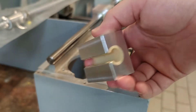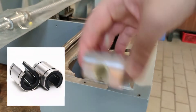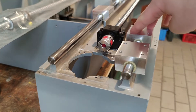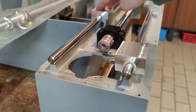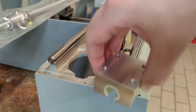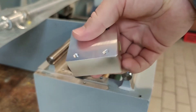First of all, why I did not buy new bearings like Split LM16UU. Linear rails are made by Thompson and are 15.87 mm in diameter. I could not find suitable bearings that would fit and were reasonably priced.